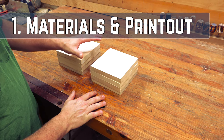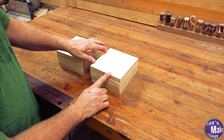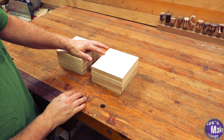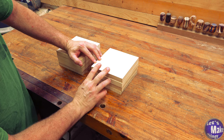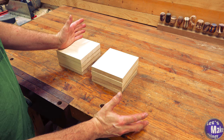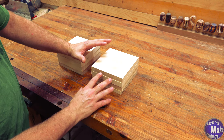To get started you're going to need two blocks that are three inches thick and six inches wide by six inches tall. Because I don't have wood that's that thick, I'll be gluing together layers. These are three quarter inch thick, six inches by six inches — you need about three inches altogether, and this will be just barely over three inches. I cut all these from a three quarter inch by six inch by 52 inch board. I made mine out of maple, but it really doesn't matter — you can make yours out of pine and you'd be just fine.